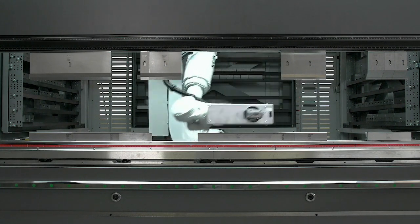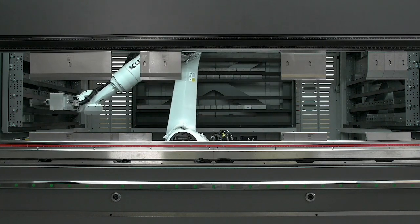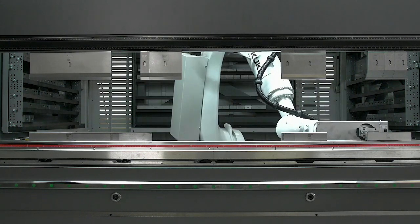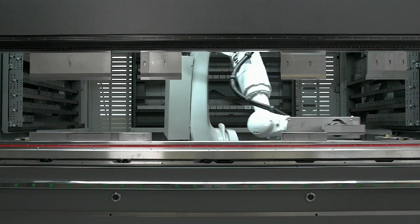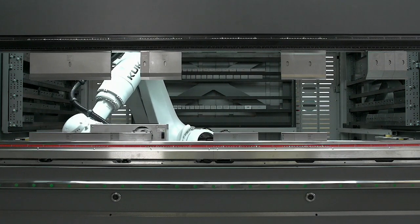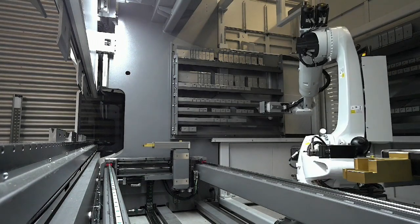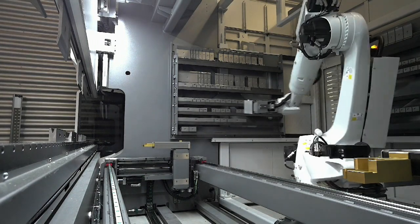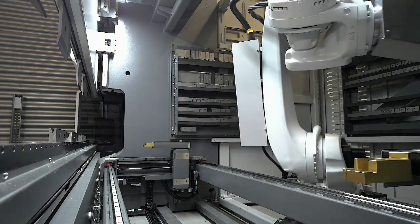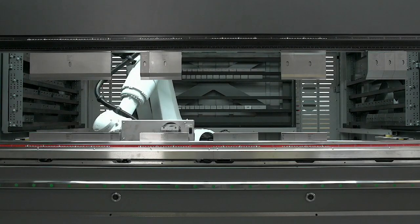The table can be cleaned after we've taken all the dies out. We never need to program anything — everything is fully automatic. We have a maximum of 52 meters of tool space storage. If you load new tools into the racks, there is automatic tool recognition and one-click storage, so no programming. We can handle up to 25 kilos per tool, the longest tool can be 550 millimeters long, we can move dies of up to V120 around, and the punches can be 350 millimeters tall.